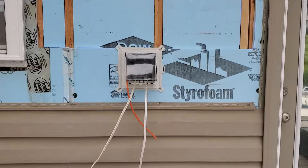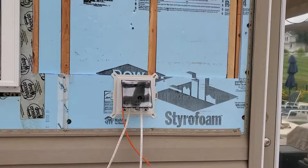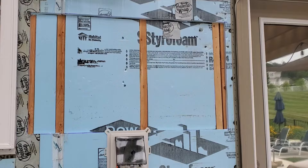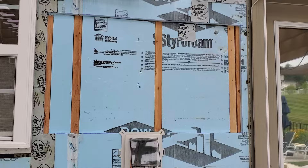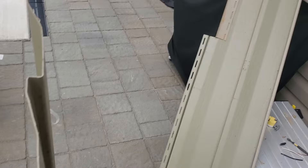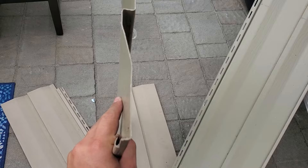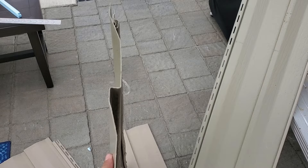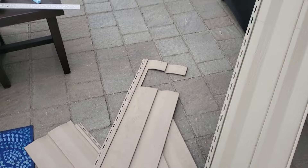It being a smart TV it'll run its own stuff, but I also wanted to be able to watch football outside. Here's what we're going to do: cut the plywood backer board, recess it into the foam and screw it in place, then wrap it in a sticky asphalt house wrap to keep air from infiltrating and keep moisture problems down. Then we'll rip some spacers for the siding — the siding stands off about a half inch on this Dutch lap, so I need spacers about two and a half inches wide and 40 inches long that sit inside the gap. That way when we lag the Storm Shell in, especially where the mount is, it won't compress the siding and it'll mount securely. I've been here, done this, got the t-shirt too many times.